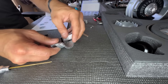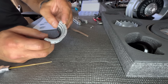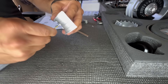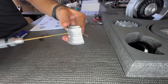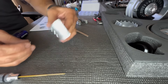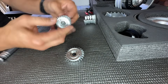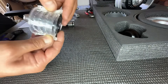Back to the engine — we are putting together the stator vanes within the compressor section. The stator vanes don't move; they are attached to the compressor case. The turbine case also has them, with blades angled in a very particular manner to guide airflow properly. Between the stator vanes are the actual spinning blades — the turbine or compressor section — all optimizing airflow for better compression and combustion. Real engines also have variable stator vanes that do move, in the beginning stages of the compressor. Those blades modulate and are controlled by fuel to optimize airflow and prevent compressor stall.